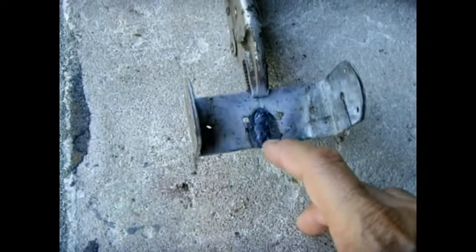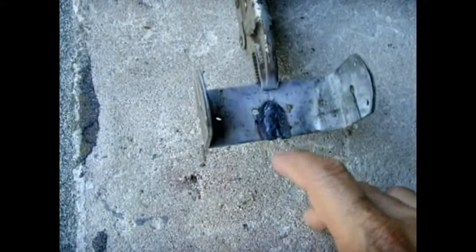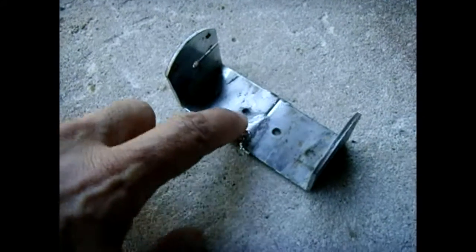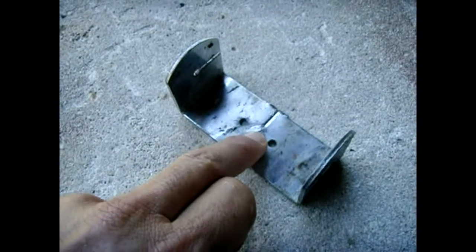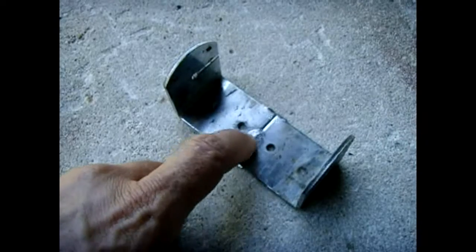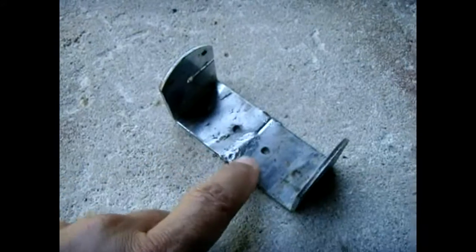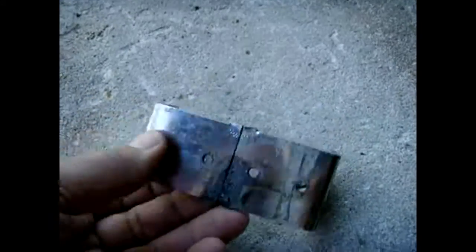What I'll do is chip this layer of slag off, take my wire brush with my drill, polish it up, and we'll take a look at it. All the slag is cleaned off — I wire brushed it and you can see how beautiful the flow went in. This is where I started the weld and kept going back. It flowed in beautifully, and right around here is where I let off just to show you how it works.